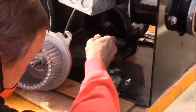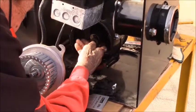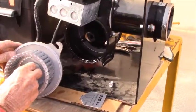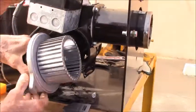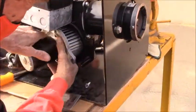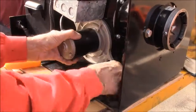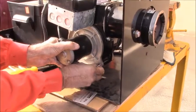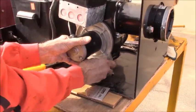Reinstall it with the orange end going to the fuel pump, making sure that it slides onto the shaft properly. Then you'll have to align the shaft on your blower motor, and it will probably take a little finessing to get it to slide in. Once it's seated, just reinstall your bolts, tighten it all up, and you're good to go.